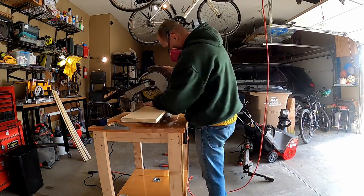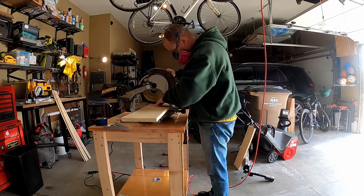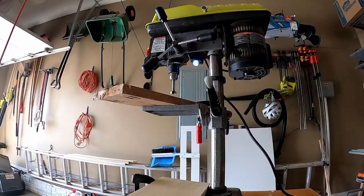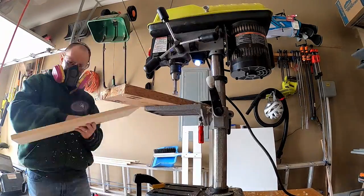In this video we're going to make a one-day shoe rack with some big box lumber and dowel rods. Right now I'm cutting the three verticals — there'll be two sides and then one in the middle. The one in the middle will have holes all the way through it, and that's what I'm doing right now with a Forstner bit. There's a reason I'm doing the middle first — you'll see in a minute.